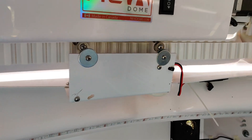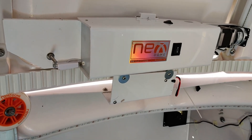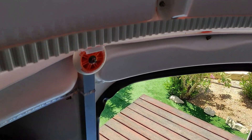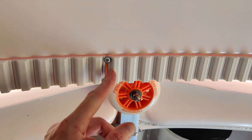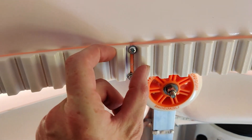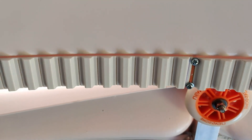You always have to make sure the dome shutter is open slightly before rotating the dome. The home switch is in the opposite position, sitting at roughly 190 degrees — that's the original magnet from the shutter kit. The open sensor magnet is up on the roof of the dome. The track was a bit of a pain to mount with Gorilla Tape — it did eventually hold but I just had to keep pushing until it stopped coming off. One end where the track was supplied tight in the centre of the roll kept wanting to peel off, so I've put a couple of screws with a washer just to join up the two ends and stop them opening up.